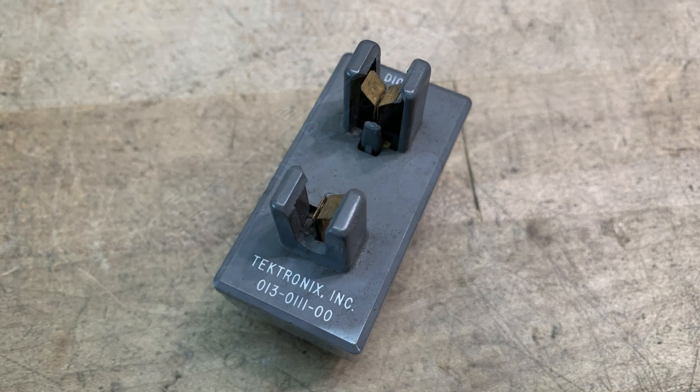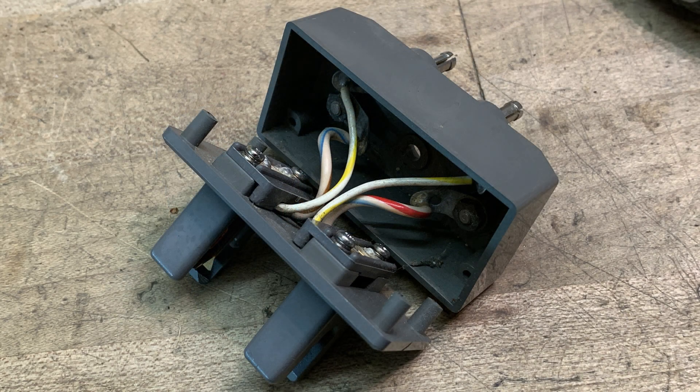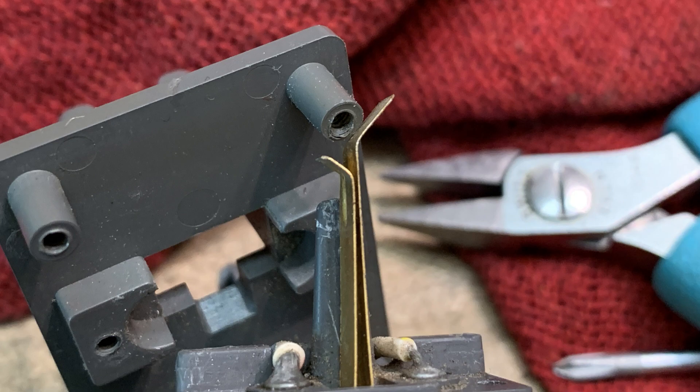The other adapter was a diode holder, and one of the little metal contacts is broken, and one of the banana jack plugs on the bottom is broken — the upper left-hand one. Opening it up, there is a two-leaf contact, and it looks like it's a Kelvin contact, which means the source and the measurement are two separate leads, one on the left and one on the right. I bent the broken contact over slightly, and you just have to slide the component a little bit farther into the test fixture — I believe it'll work just fine.